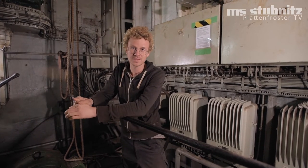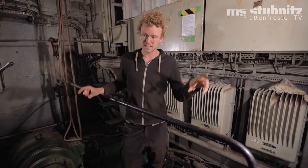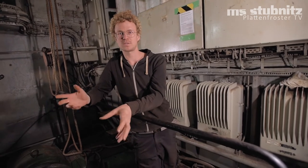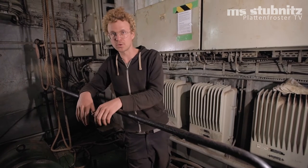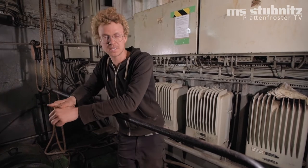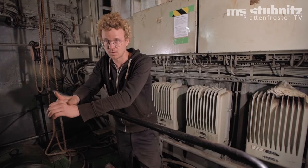That makes things relatively challenging. The tank is about 80 cm higher at the ship's sides than in the middle, and the access points are only on the outer sides. Currently, we can't pump the water that collects in this tank out ourselves — a ship comes alongside with a large pump on board, throws over a thick hose, sticks it into an opening on the sides of the tank, and tries to get the tank as empty as possible. That works more poorly than well. Due to the complex layout and tight construction, you can never reach the middle of the tank or its lowest point. So we never actually manage to fully empty this tank.